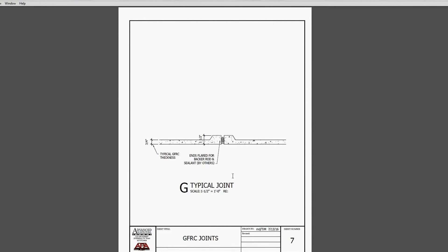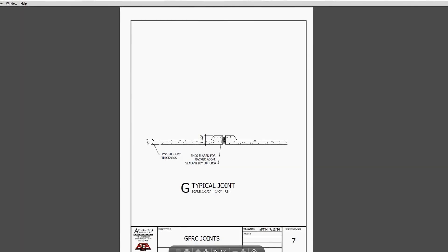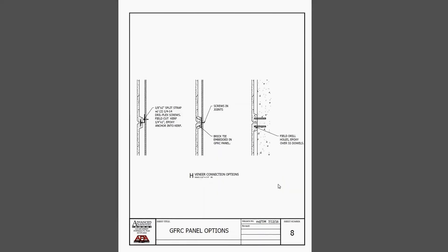Here is your typical joint connection - not really a connection, but what we do here. We typically spray the GFRC up to about three-quarters of an inch thick, and here we built up the edge. Anywhere the GFRC pieces come together or meet up to the building and need to be sealed, we thicken those edges to approximately an inch and a half thick. That leaves room for backer rod and caulking or grout - whatever you're going to seal the structure with. This photograph shows that built-up added thickness at the edges, giving you plenty of room to tuck in backer rod and seal the joint.